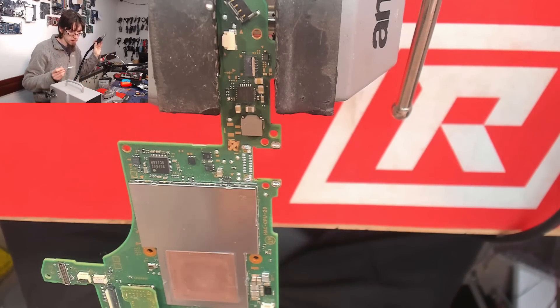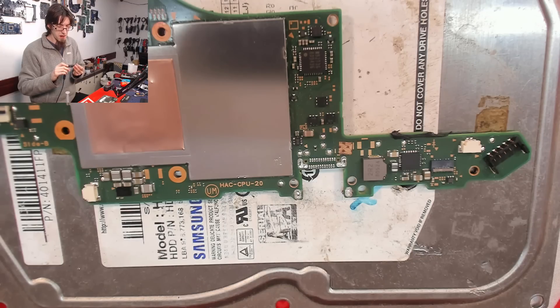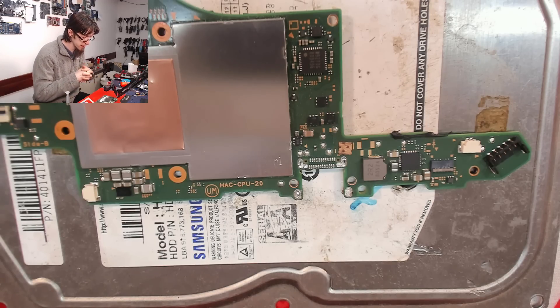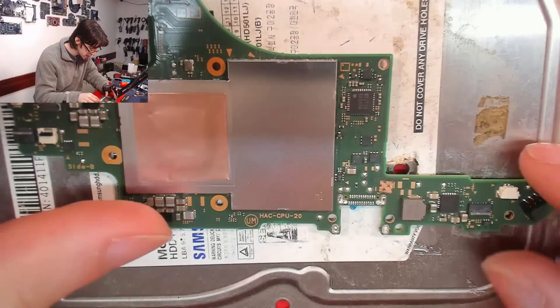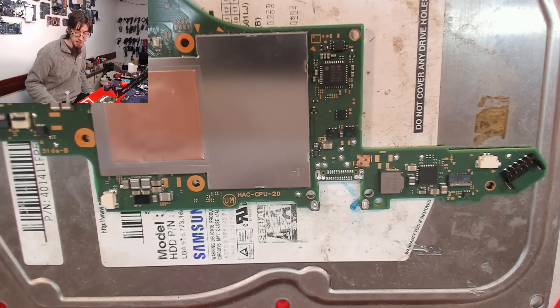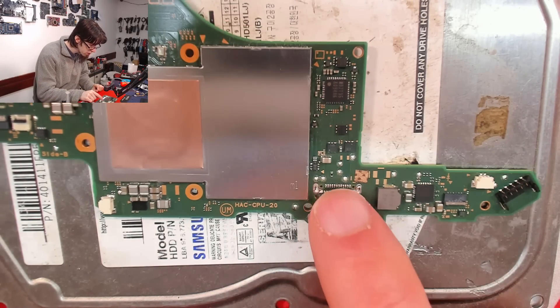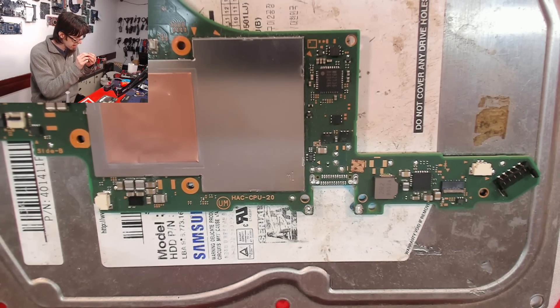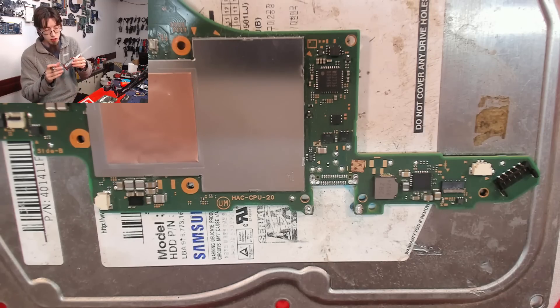Good grief, that didn't go without a fight. That was horrifying. I was expecting it to put up about the same amount of fight as a micro USB port — however, no, that put up way more fight than micro USB does. Either way, it's off now. So what we're going to do next is flow solder across all those pads and clean them up, then use my solder pump to clear those holes, and then I can just drop the new port in. Though I think we'll still need to do a little hot air since there are two rows of pins.